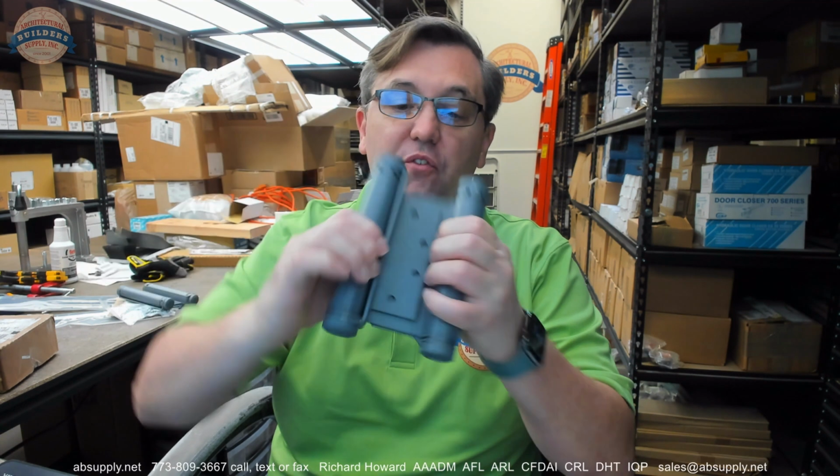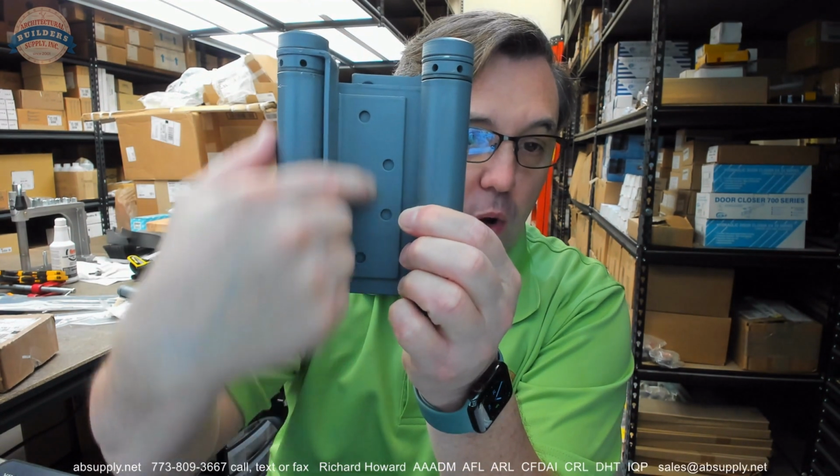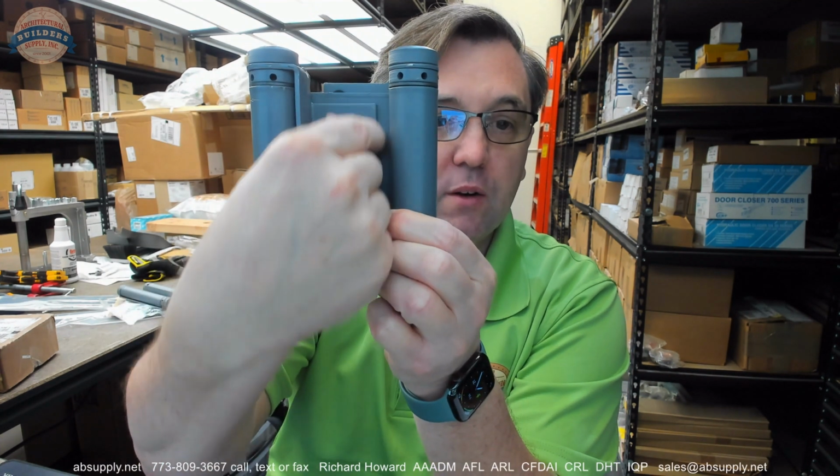It can kind of be made to be the right hinge by mortising the face of the door on both sides to put the smaller hinge on. If you were to say 1 inch, no, this wouldn't be the right hinge either. The template pattern of the screws just wouldn't allow a thin 1-inch door to fit in. So 1 3/8 to 1 3/4 is the door range.